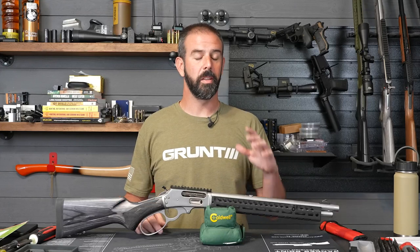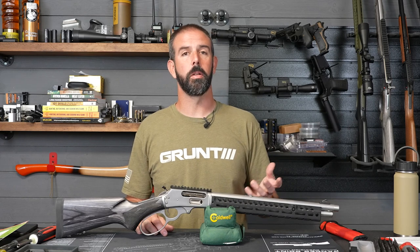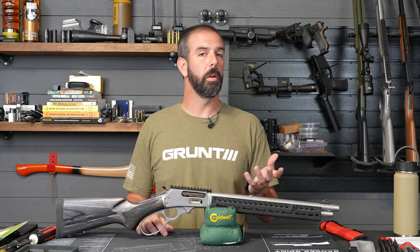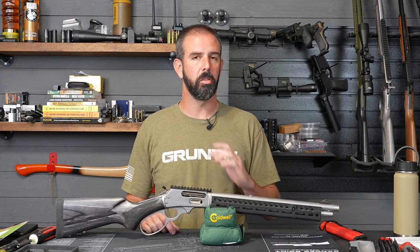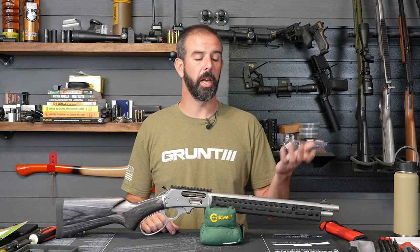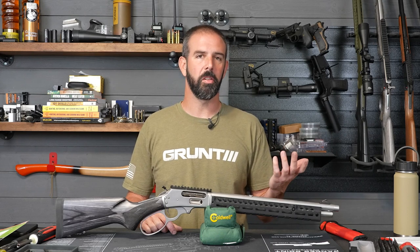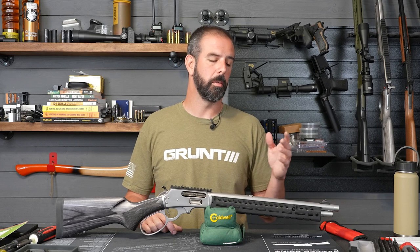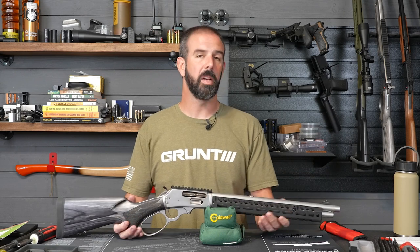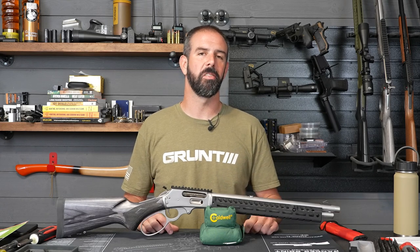Well guys, that's all there is to this install. Like I said, this is extremely easy. The hardest part is sanding down that tenon — it's time consuming and monotonous, but not really that difficult. Stainless just doesn't go easily, so it takes a little time with the sandpaper to work it down. You could use something powered like a belt sander, but there is no way I would do that because it's so easy to take too much, and then you've got to order a new tenon. So take your time and do it by hand — it took me maybe 15 minutes. It's a rock solid installation. I love the way it looks and feels, and it's definitely a great addition to any rifle. Hope you enjoyed this — if you did, give us a big thumbs up, hit that subscribe button, and share us with your friends. Have a good one guys.